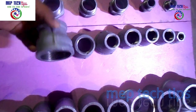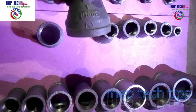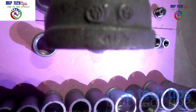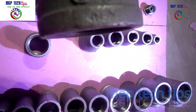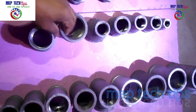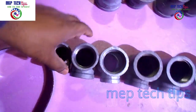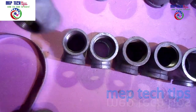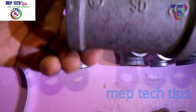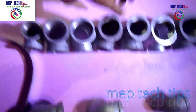These are the threaded fittings. Threaded fittings are available from half inch to two inch only. These are reducers — you can see these are reducer threaded fittings. They are also UL listed and FM approved. FM is an international leader in third-party testing and certification services. They normally test property loss prevention products and services for use in commercial and industrial facilities.